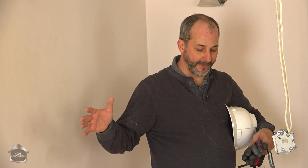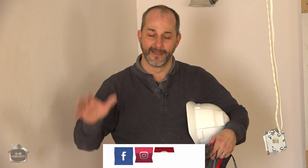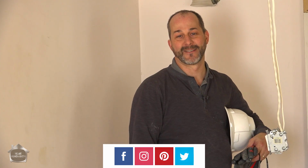So it might look sketchy. It's definitely not up to our current standards, but if you're worried at all about it, grab a bracket, throw a couple of structural screws into it, or cut a 2x4 and stick it under there just to create some temporary point load. If you need to do something like that to help you sleep, that's fine. But other than that, just mark any holes in the floor, make sure everything's covered up and no one's going to have an accident if they come through and take a look. Because we all know when you're renovating in your own home, the family always comes through to take a look. So clean up, make sure all the nails are covered over or nailed back down into the floor so that your kids and pets are safe.